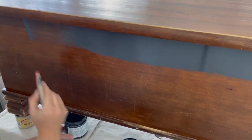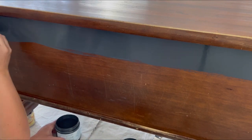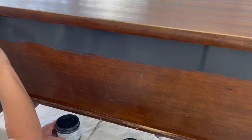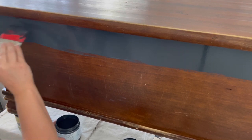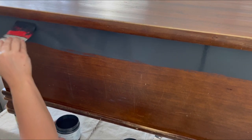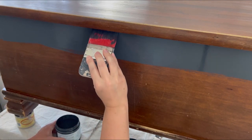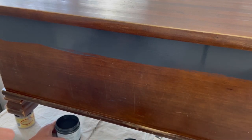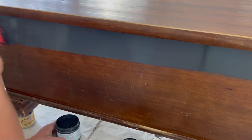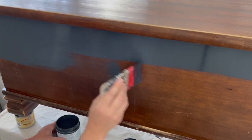I have minimal brush strokes and I really don't have to use a lot of effort. That's really important when you're using silk because you can't use your water mister. With chalk paint it smooths out with water, but with silk you just need to rely on your brush and the drying time. It's really important to let your silk dry before adding another coat. Dixie Belle recommends two hours of drying time in between coats. During that two hours, the paint self levels, so you'll get your best results if you're patient and wait for it to dry completely.